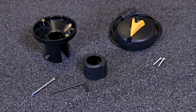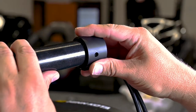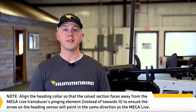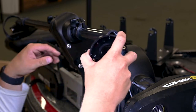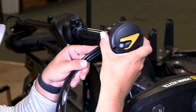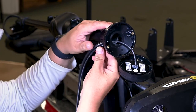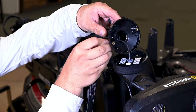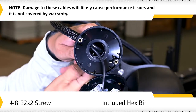Next, we'll get into installing the MegaLive target lock heading sensor. Slide the heading collar over the cables and shaft and align the holes in the collar with the holes at the top of the shaft. Align the heading collar so that the raised section faces away from the MegaLive transducer's pinging element, to ensure the arrow on the heading sensor will point in the same direction as your MegaLive. Feed the heading sensor cable through the heading mount and position the sensor on the mount so that the arrow on the sensor points away from the gap in the mount. With the gap in the mount aligned with the raised section of the heading collar, slide the mount over the transducer cables and collar so that the transducer cables and heading sensor cable exit the mount through the gap. Slide the provided sleeving over all three cables, pushing one end into the opening of the mount. Secure the heading collar and mount to the shaft with the included screw and hex key. You may need to adjust the positioning of the cables to make room for the screw.